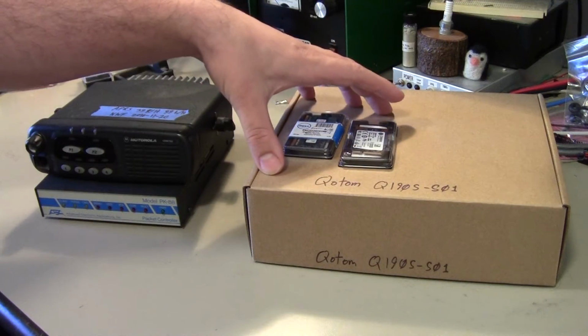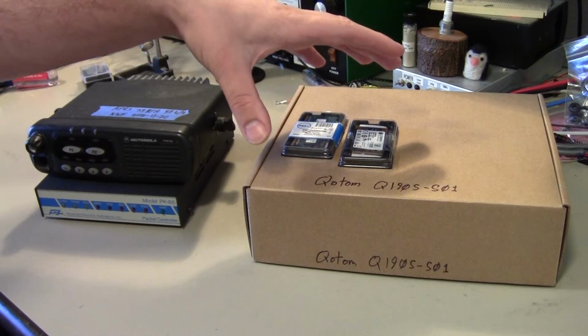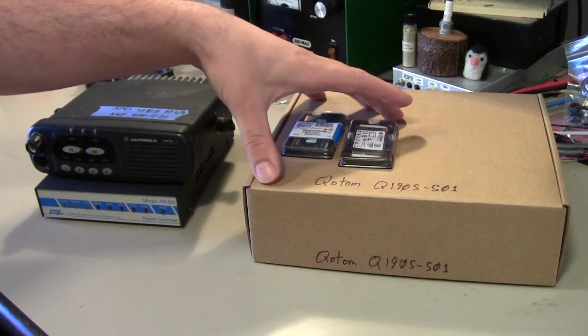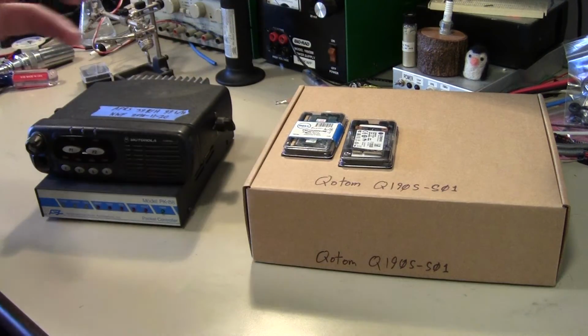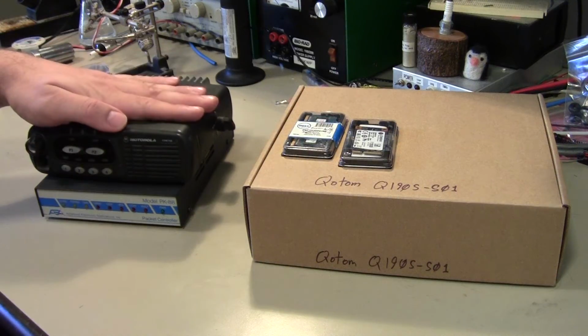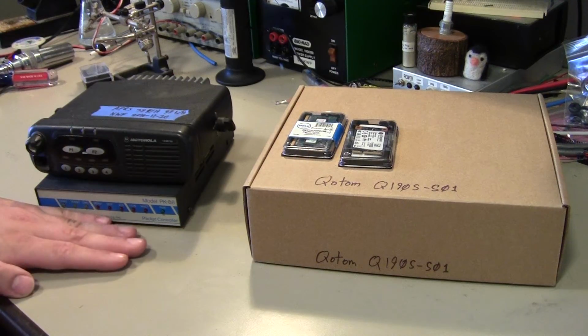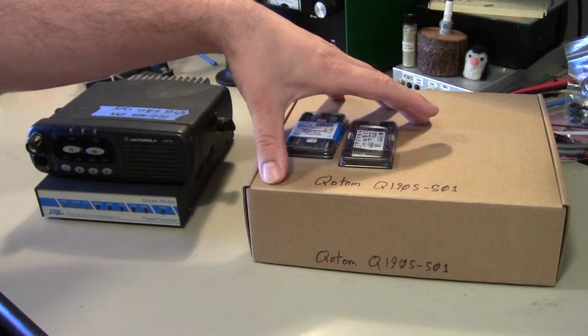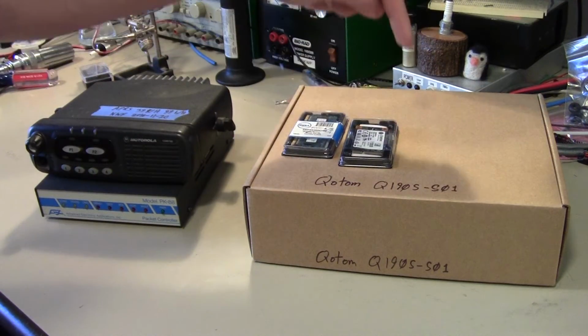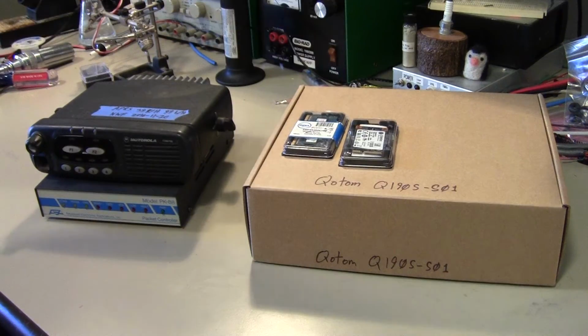You will also need a computer for when you want to be an internet gateway instead of or in addition to being a Digipeater, right? And so on the internet gateway side, radio signals come into here, the audio signals are decoded in the TNC, the KISS serial stream goes to a computer, which translates these to the internet connection, which would come out from there.